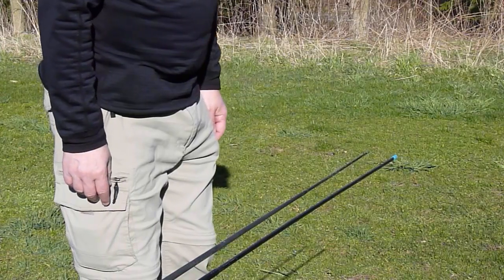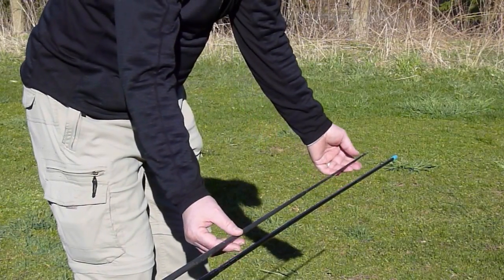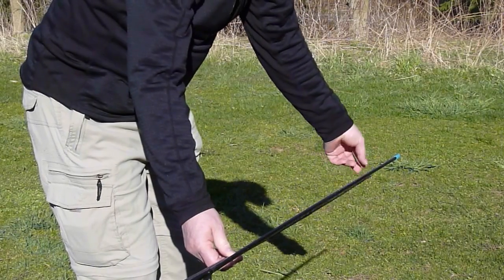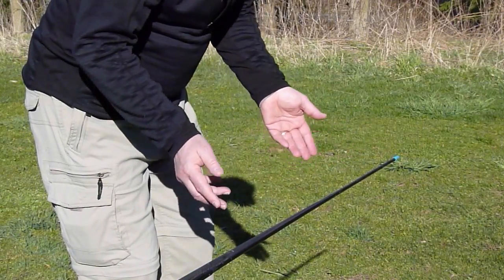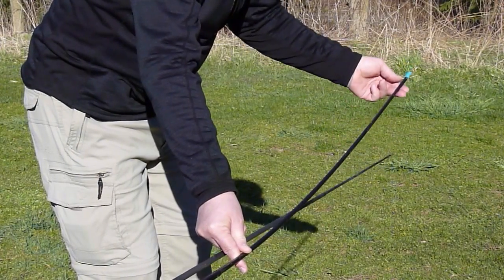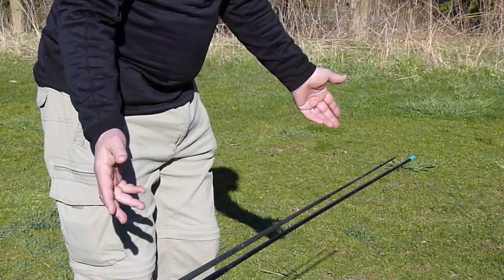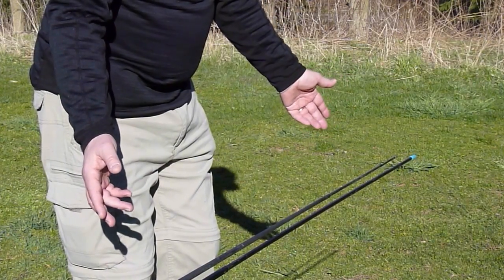One more point about the comparison between the Jackite pole and the Spider Beam pole. The Jackite poles do have a fair amount of flex — here's the end tip, you can see the amount of flex I get without applying too much pressure. Now take a look at the diameter of the Spider Beam — considerably thicker at the top. This thickness throughout lends to the difference in weight, but also means much less flex. An antenna supported with the Spider Beam is going to remain more vertical, though with a heavier mast you may need to guy it in windy permanent locations.